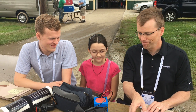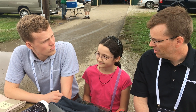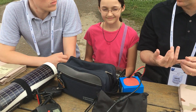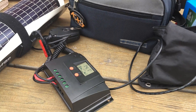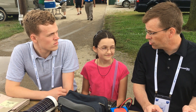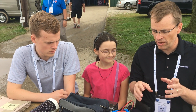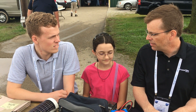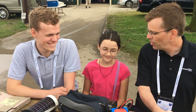Is there any other type of setup you can use with different types of batteries? Sure. If you get the right charge controller to go with it, you can charge lead acid batteries or lithium iron phosphate. It's all about getting the right panel paired with the right charge controller. One of the keys in ham radio is to make sure you get a charge controller that's electrically quiet, because you don't want to go to field day and have noise coming into your radio from the charge controller. You don't want RFI — that's bad, nobody wants to listen to that.